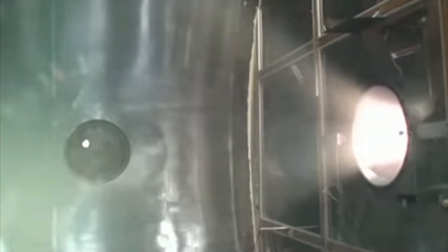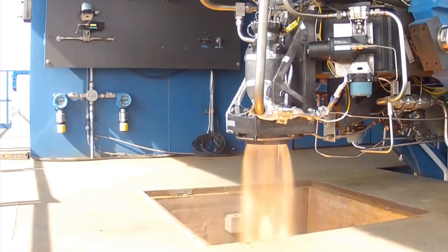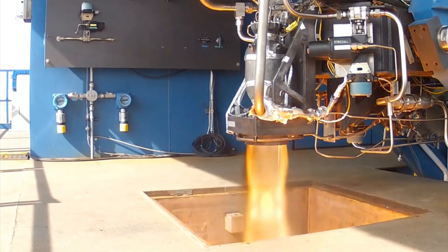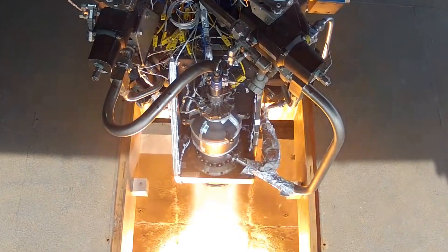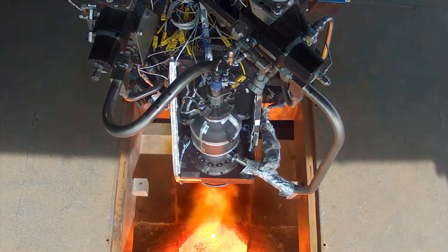However, if you're using something like VASIMR, where you're using magnetic confinement on a hot plasma, the plasma that comes out is so hot that you need a water jacket to cool the vacuum chamber while testing. But once you get up to larger engines, this simply isn't possible. A rocket engine is something designed to take fluids, combust them, and produce a lot of gas very, very quickly — this is what they're optimized for. There's no way you can build a vacuum chamber with mechanical pumps that can keep up with this perfectly optimized beast of a rocket engine. So you need to use the rocket engine itself to help you with the pumping mechanism.